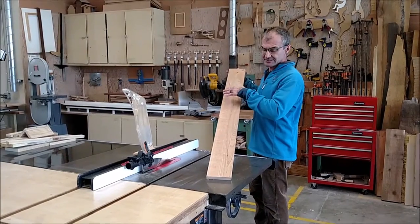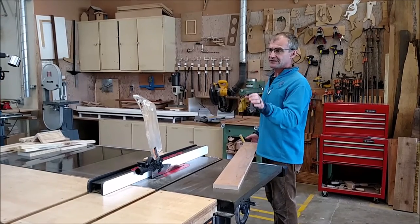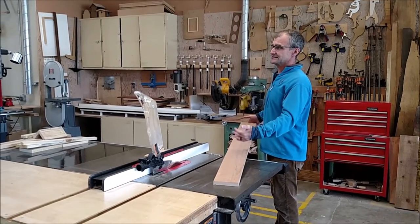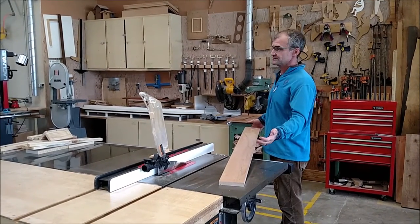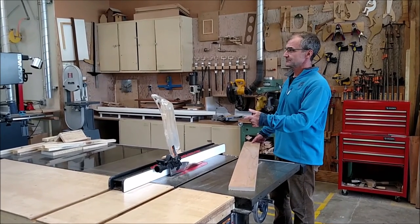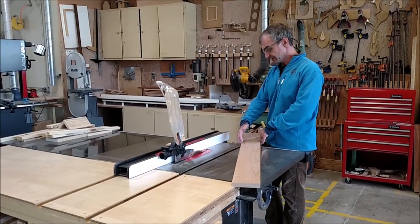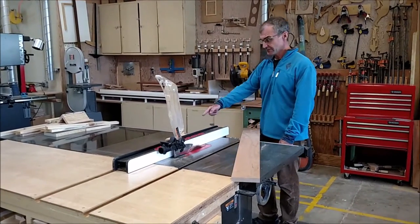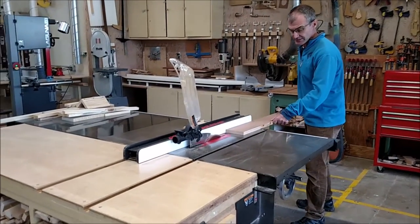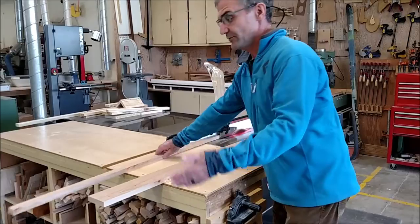There it goes — the laser engraving has started. For the rustic cherry frame, my inside dimensions are six by six for the glass, but since I'm cutting miters I want to go more like nine inches per side times four, so at least 36 inches of board. If everyone uses the same dimensions, off-cuts from one person could be used by another.